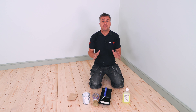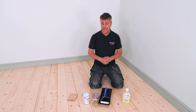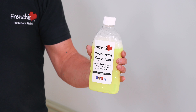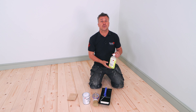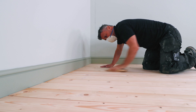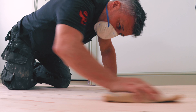Preparation is the key to every successful job because if you fail to prepare, prepare to fail. I'd certainly advise starting off by scrubbing all the surfaces down with some sugar soap mixed with hot water, really scrubbing those surfaces. Once you've rinsed them through, dry them out and then you can start your sanding. We recommend a good scrub with sugar soap, rinse and allow to dry, then followed with a light hand sand sufficient to abrade the surface. Vacuum away the dust and then you're ready to go.